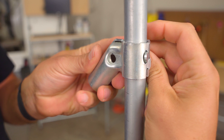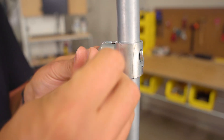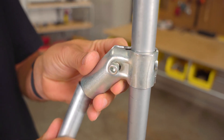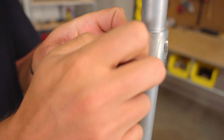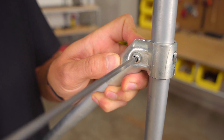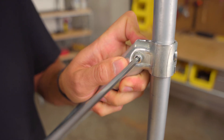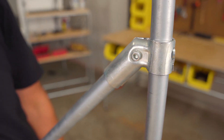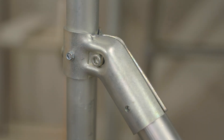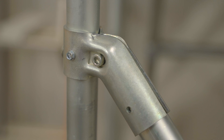Hold a nut inside of the hardware pocket on either side of the connector and loosely thread in the bolt by hand from the opposite side. Slide a piece of conduit in the bottom half of the connector and switch to tightening the bolt with your 5mm hex wrench. The nut should stay in place while you tighten the bolt on the opposite side. Fully tighten the bolt to complete the connection. Some available sizes of the 45 degree connector have pre-drilled holes for self-drilling screws — number 8 by half inch will work best. These are optional and can be added now for extra security.